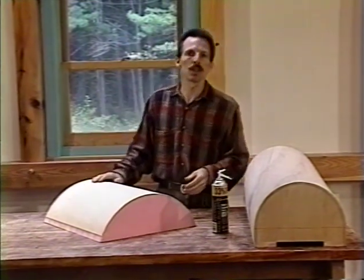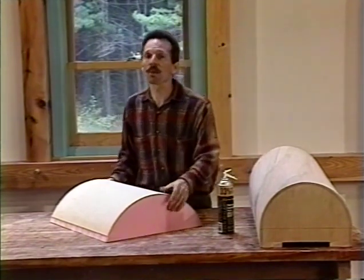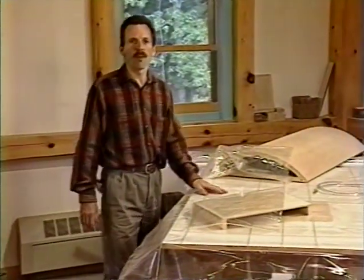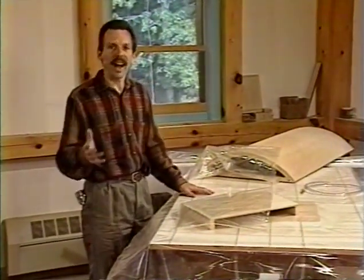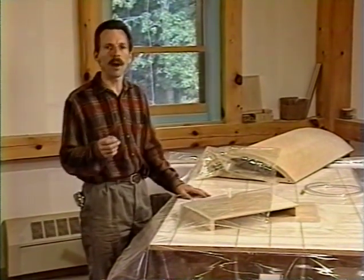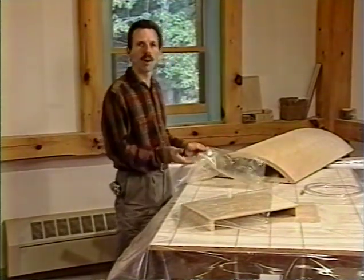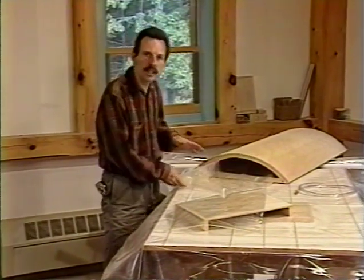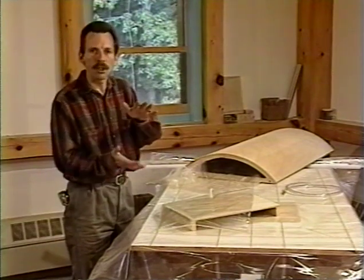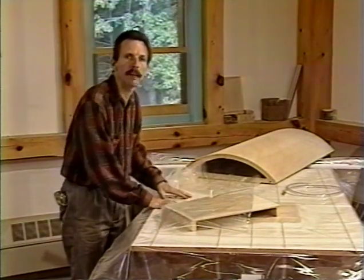Although I tend not to use this foam technique much because of the bulk disposal issues, it sure makes for an awful light form. Now, the method I like of supporting a form is, oddly enough, using vacuum against itself, so to speak. This is accomplished by using a product I call an AirForm. Let me explain. An AirForm is just another bag that goes inside the form and inflates itself under vacuum to provide internal pressure against the outside pressure bearing down on the bag.